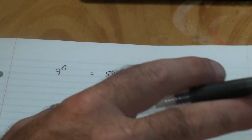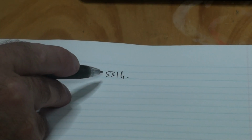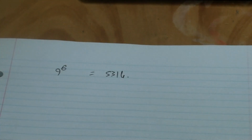There are, at absolute maximum, about 500,000 possible key combinations, but it's actually quite a bit lower than that, okay? And the reason for that is that some key bittings are not allowed. So you can't have a very, very high key bitting next to a very low cut, for example.